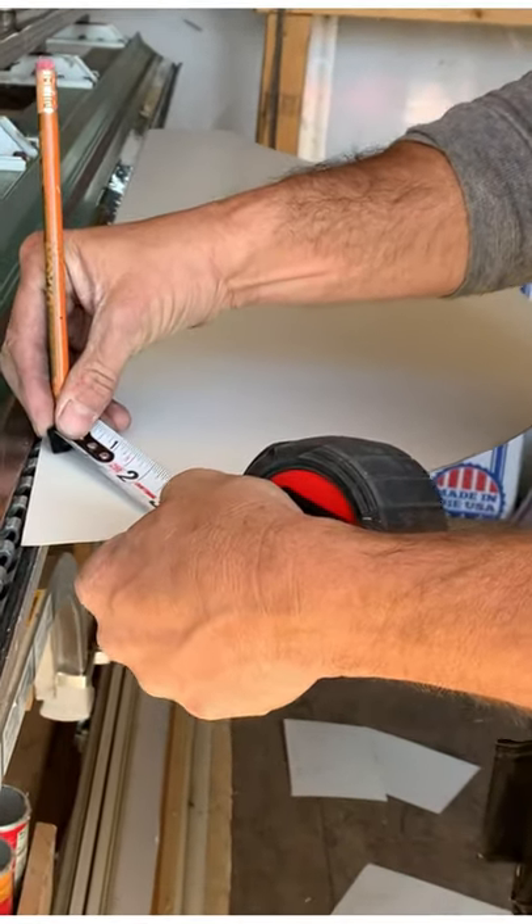I'm a little big — you can see my fingers are kind of hidden quite a bit there — so I'm going to notch out. I'm going to cut on the brick side, not the outside line. That outside line is perfect, so if I want to trim something I'd rather be on my brick side where I'm going to caulk and seal. I want to keep that nice, pretty arch on the outer edge.